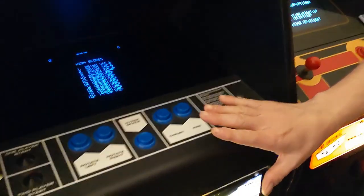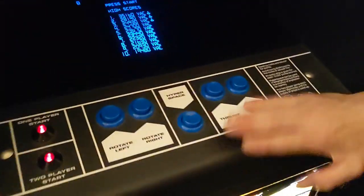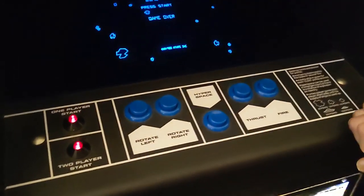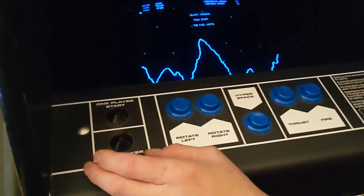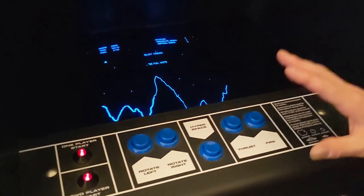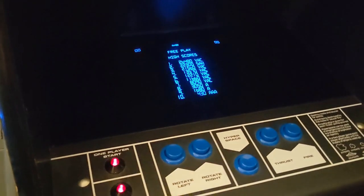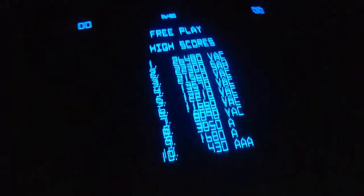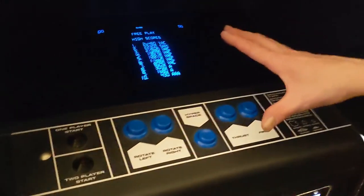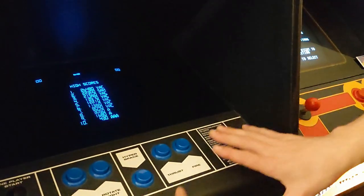I love playing this machine. This is an Asteroids cabaret — original. I did a different control panel and a different coloured screen, made it a little bit different. I think this is nicer to play than the upright. At the moment it's got Asteroids Deluxe on it. If you press two and one together, you get Lunar Lander — you can actually play it with the thrust button; you use the hyperspace button and just tap it. And press once more and it's back to normal Asteroids. That's a tiny board that fits over the main CPU 6502, and the 6502 goes on top of it. So that is real hardware running that.